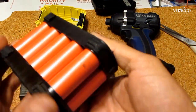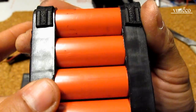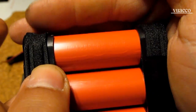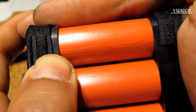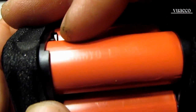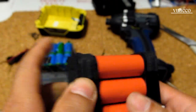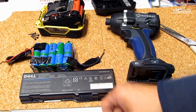This other cell's model number is imprinted on the cell, not printed, so it's kind of hard to see. But using a light for reflection, you can see the model number: UR18650RX, and the brand is Sanyo. This cell's discharge rate is 22A, while this pack's discharge rate is 2C max. Let's get started.